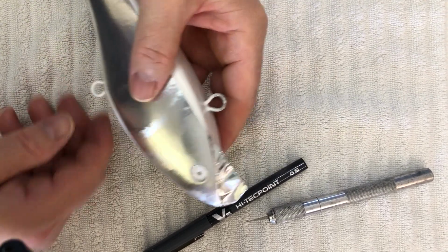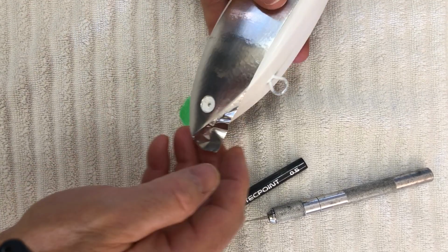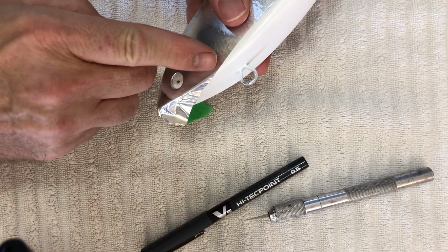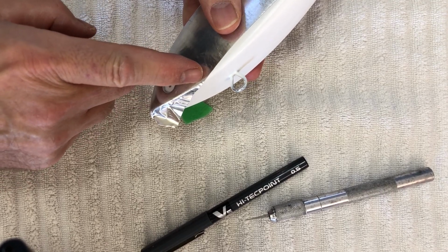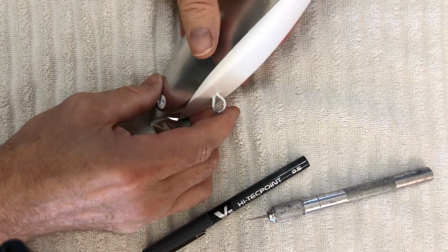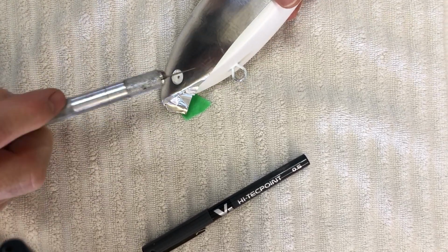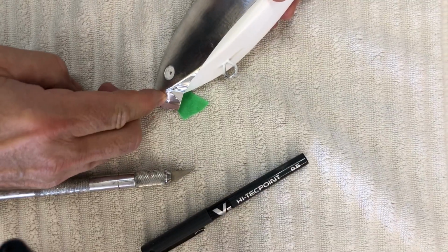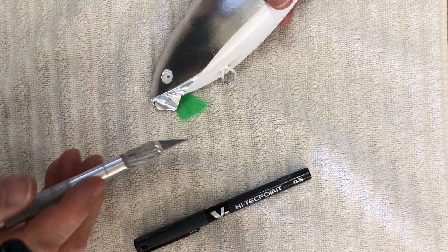So now what I'm going to do is I have a couple more cuts to make. One is a little different. This one here is along the flat face. Now, if I try to use tape along this side, it's always difficult, and what happens is the tape may be not quite right and you may cut over top, and quite often what happens is you make a scar on the face and you have to fix it. So I want to make a cut right along here, but in a little bit. So I want to be on this side.